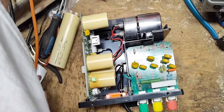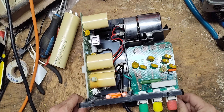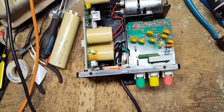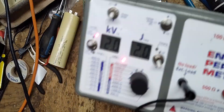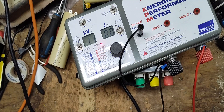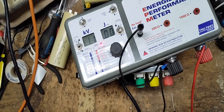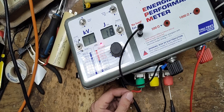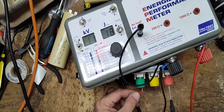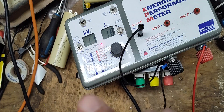Let's plug it in. See — a little slower, right where it's supposed to be. We'll do an open circuit reading and look at the pulse speed number. It reads about 1.1 seconds — supposed to be 1.2 to 1.4 seconds. I was a little off, but that's right where it's supposed to be. Now let's switch back to kilovolts and joules and do the open circuit voltage reading — about 6.8 kilovolts, right where it's supposed to be.